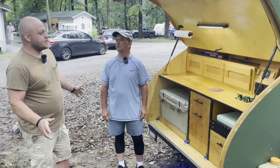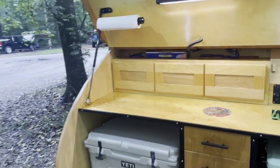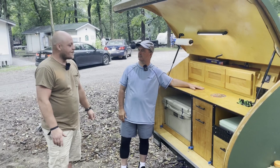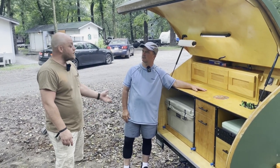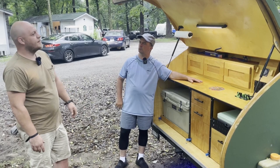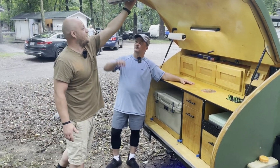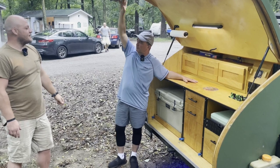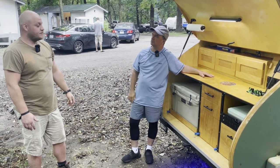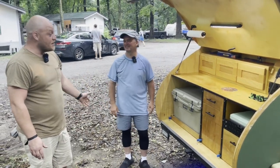Back here on the galley, this is Baltic birch. You framed this out — what did you finish with? This is spar varnish, just like they do on boats. I figured that'd be better for water, and that's what Mike uses on Camp and Camera as well. Tony gives you some options and that was one of them. You cut your splines out of plywood and bent this — where did you source this material? This was the hardest thing of the entire camper to get. I built this during COVID with supply issues. I live in Knoxville — I had to drive to Toledo, Ohio to source the Baltic birch. You still saved a lot of money, but it was expensive birch — at least you got to go on a road trip.